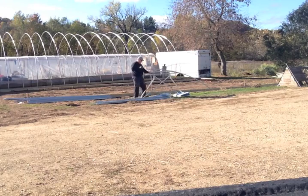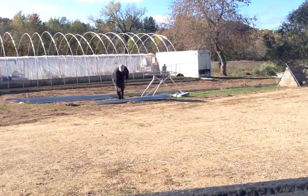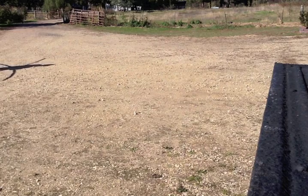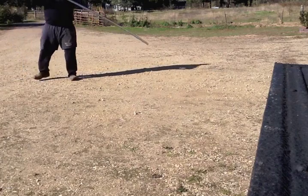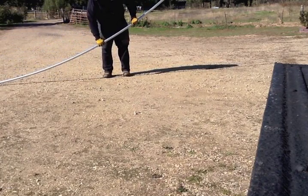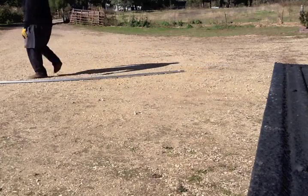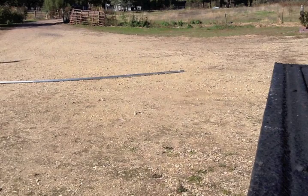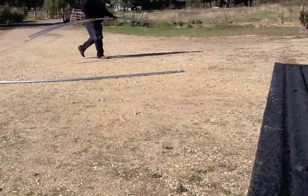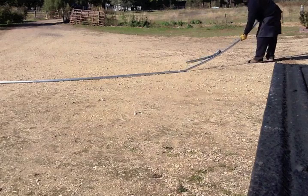I did seventeen of these hoops, all in about three and a half to four hours. The only thing I have left to do is put the supports in, which will be three rows of the same ten-foot six-inch posts connected end to end along the top, and two more out a little ways — so that'll be another fifteen poles per hoop house. Then I'll do two-by-four treated boards down lower so I can create curtains and do the roll-up. All of it I'll make myself.